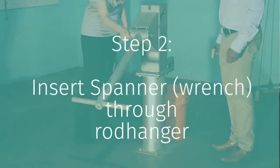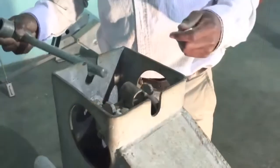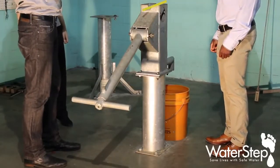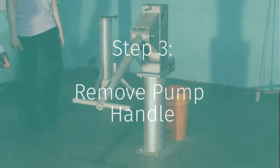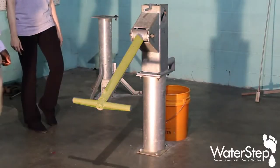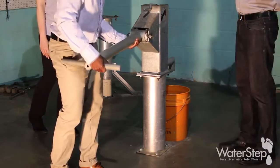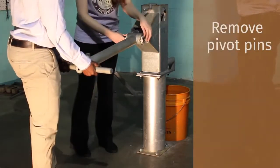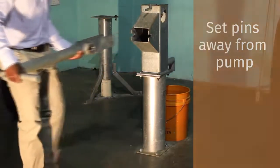We've got the bolts loosened. What you want to do is take the tool that you used to loosen the bolts — there are two slots in the very top of the pump. Slide the tool in the slot and through the loop on the end of the sucker rod to support it while you remove the handle. After you've removed the cover and loosened the four nuts off of the pivot points, raise the handle about halfway up and very carefully slide the handle back out, letting it rest on the edge of the pump. Slide it all the way back so you can remove the pivot pin — a metal pin that goes all the way through with a plastic piece on either side that will just slide out. Once you've removed those, lay them aside and slide the handle out for later installation.